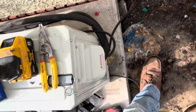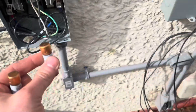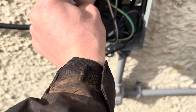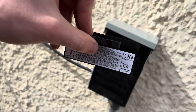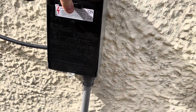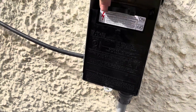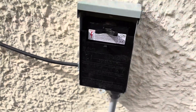Here are the fuses I use - 250-volt AC Bussmann fuses - they go right into those slots. Both are in, good to go. I ran the wire up and connected it by the wall to make it look cleaner. Make sure you don't have the breaker hooked up while putting this together - all power is off. The disconnect switch: this way is on, this way is off. Once the pull-tab is pushed in, it's considered on.